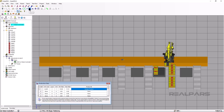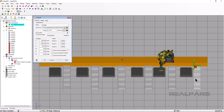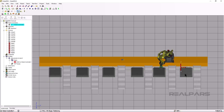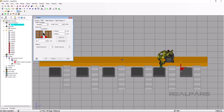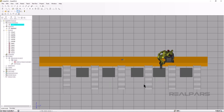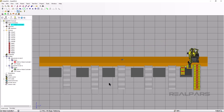Now we will add the E1 position for pallet 6 and infeed 6. Double-click on infeed 6 and click on the Infeed tab. Change the E1 value from 0 to 6700 millimeters, then click Apply, then OK. Double-click on the pallet, click on the Pallet tab, change E1 to 6700 millimeters, then click Apply, then OK. Now click the Start button to run the cell. Change the pallet and infeed to pallet 6 and infeed 6, click Start. When you're done, verify the simulation, then press the Stop button.